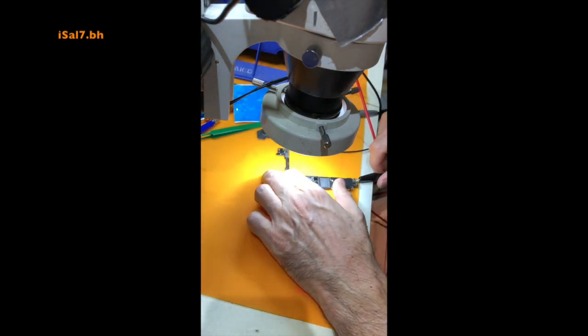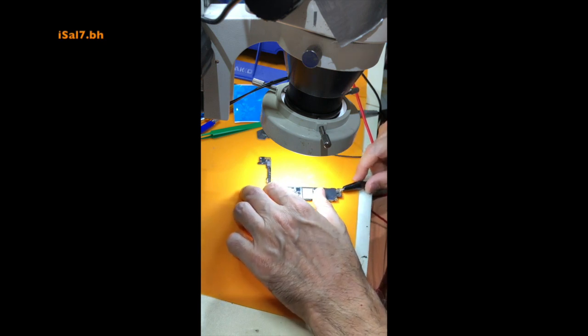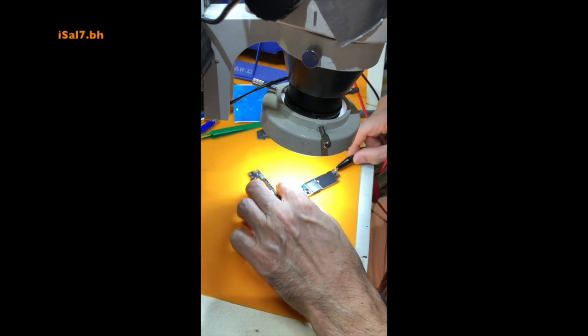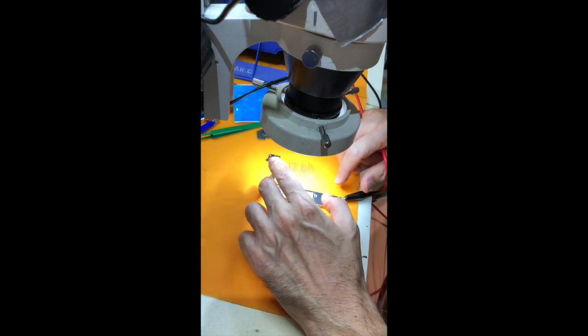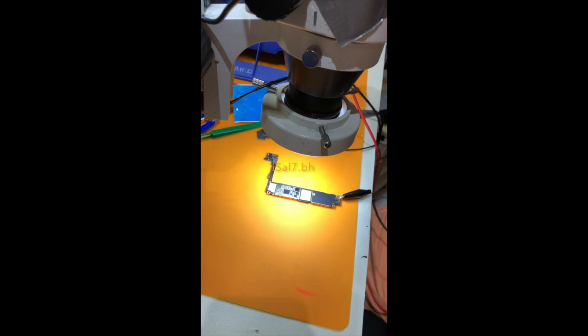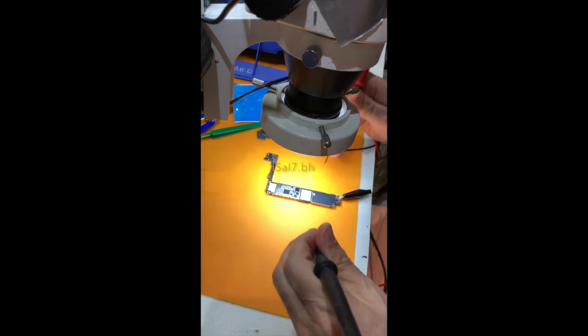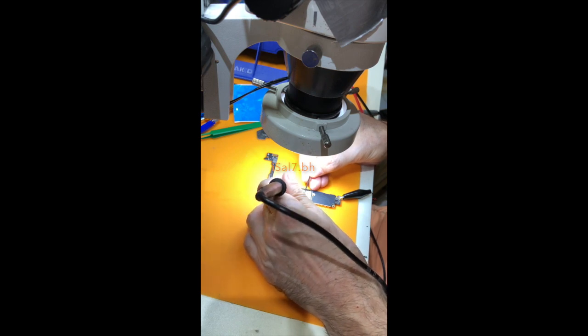I connected to a DC power supply, hooked up the ground clip, and injected current using a probe. I don't solder down a wire to the VDD Boost circuit — just inject the current with a probe. At this point I'm checking the boost diode mode and verifying if the short is on VDD Boost or not.